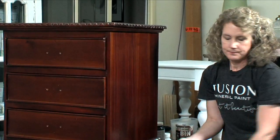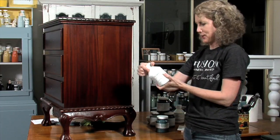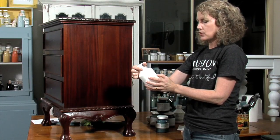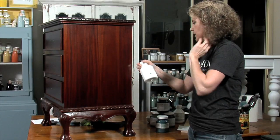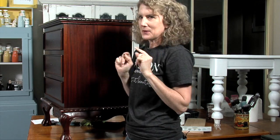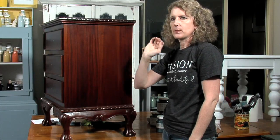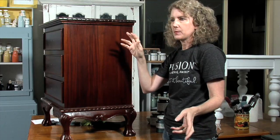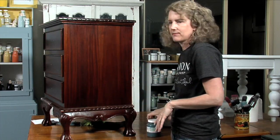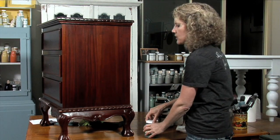Mia wants to know how long you should wait before going over UltraGrip. It says on the bottle: apply one coat for best results, let dry for 12 hours before your subsequent coats of Fusion, and clean up with water. I don't always wait the full 12 hours, but do as I say, not as I do! It depends on the day — if it's a super drying day. Today it's quite overcast with some rain, so I would let it dry the full 12 hours. If it's just for yourself you can be a little more flexible, but if you're doing pieces to sell, wait the full 12 hours for extra security.